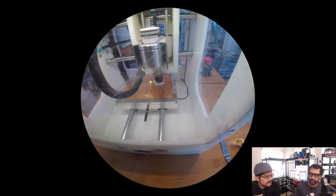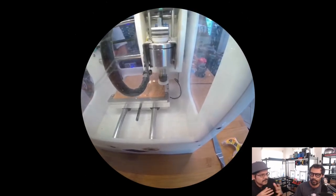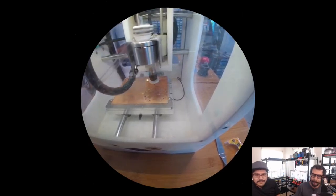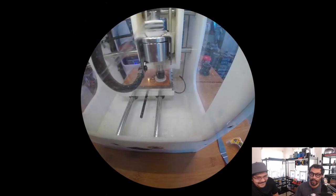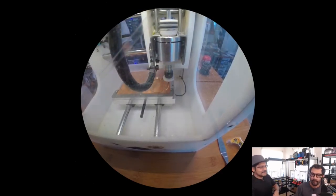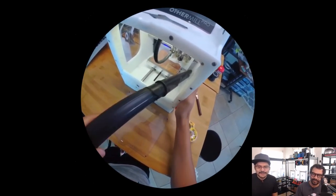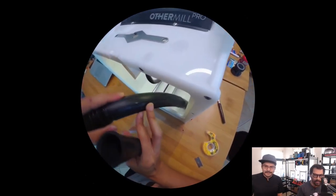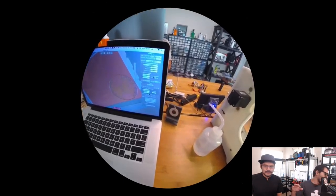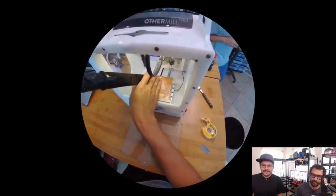Normally, when I first started milling on the Bantam Tools, I would use like three tools because my traces were super thin. I didn't know how to optimize my traces. So I'm using really thick traces, like 36 mil traces. Whoa. It can do 6 mil. I'm doing 36 mil because why not? I want these thick, chunky traces, especially for the thing we're doing with the big pads. This could be used for doing conductive touch, or capacitive touch. Yeah, conductive touch.